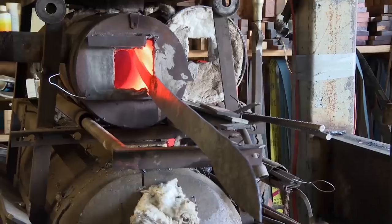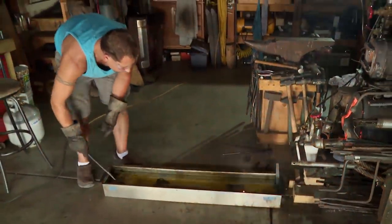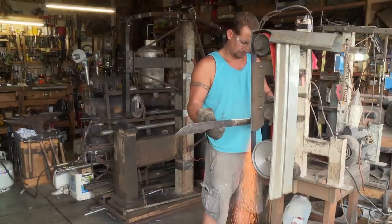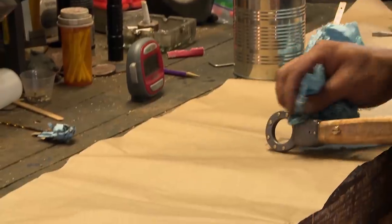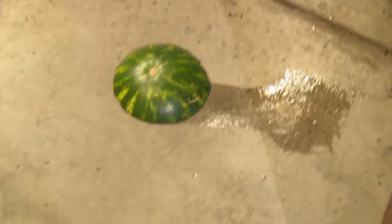I like working by hand more. I feel like I have more control. But the best thing about the power hammer is that it saves time. I think I left Joe in a pretty good spot. The quench is nerve-wracking. If you tilt it, if you turn it, it can cause a blade that normally wouldn't warp to warp. It looks absolutely gorgeous. Now I've got to thin the blade down quite a bit, so what I'm looking at is a nice, even balance so that this blade will sail through whatever it is that they put in front of it. Casey wanted to inlay pins in the ring — one for each of the competitors — so we're going to have two pins that hold the pommel to the tang, and then six more pins in the ring on the bottom. I think it turned out amazing. It's going to slice and dice anything they swing it at, and there is no edge damage.